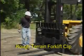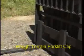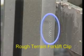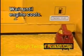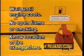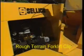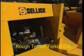An overall inspection for cracked welds, metal fatigue, and fluid leaks assures you that safe operation is in your hands. Never use forks that have been modified, and do not exceed the combined capacity stamped on each fork. Never fill the fuel tank until the engine has cooled, or while near an open flame, or when smoking. Know where fire extinguishers are kept on the work site. Proper fluid levels — including engine oil, coolant, hydraulic, and transmission fluid — should also be checked prior to operation.